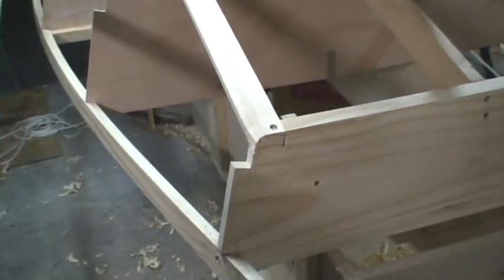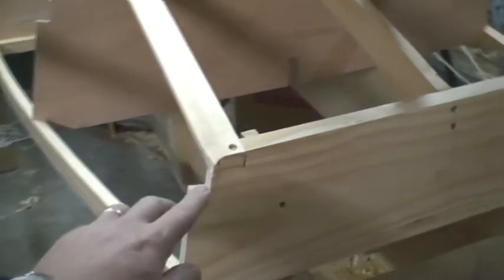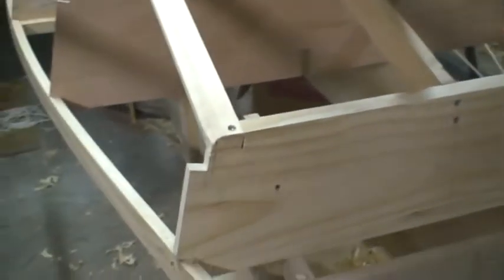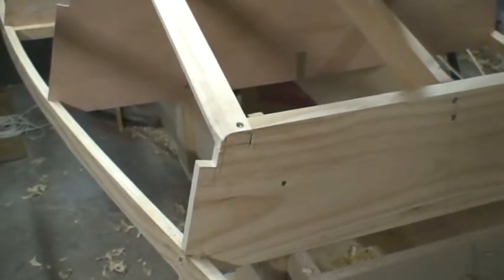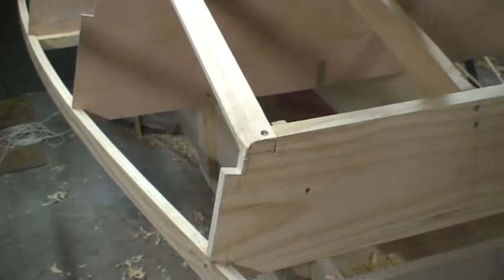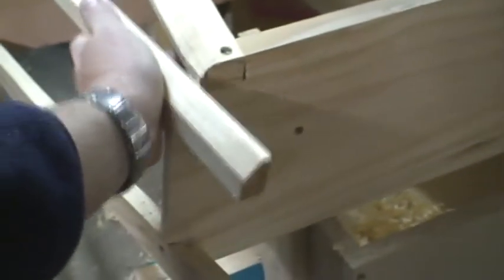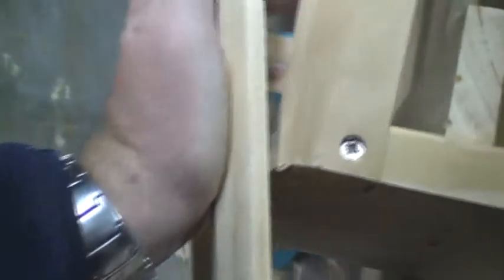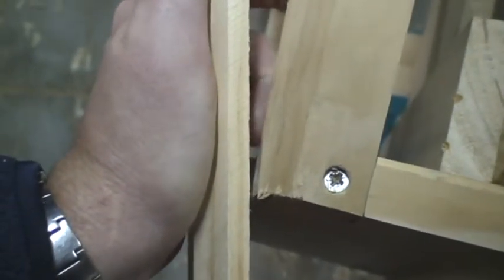To let Chine number 2 in here up at the bow — we've got Chine 1 in and I've cleared it off right at the bow to get the front edge out of the way. These are not glued in yet but they'll set back on their marks once we put the screws back in. As the chine comes in, we end up with that slot on the other side here, and this is the area that we want to line this up with.